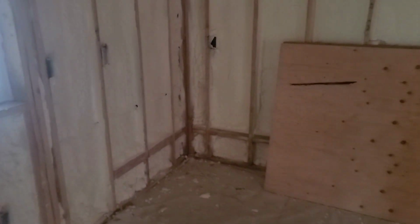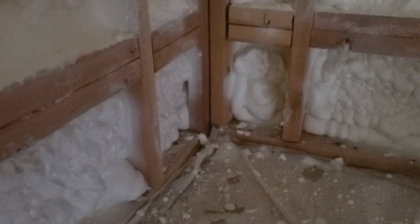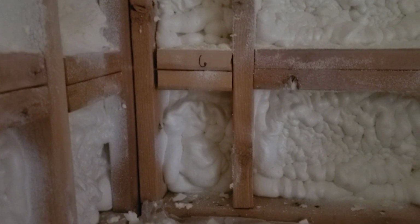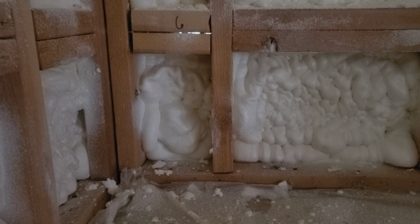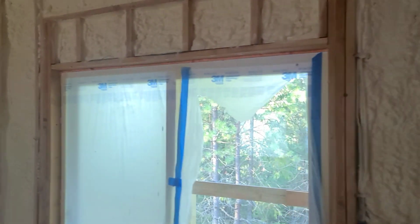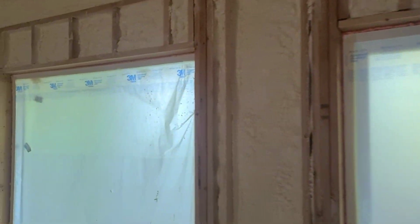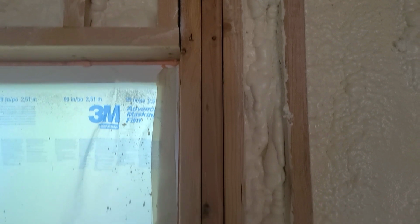So let's go around. I'm going to flip the camera. We'll go around this stuff. Some of the connection points, like that, that's a shear connection. Let's see if I can get the camera down there right. There you go. Do you see that light through there? That's a seam on the outside wall on the sheeting that matches up with that. The AeroBarrier guys came in and found all the holes, took pictures, and went around. Here was one, or they say there's one. They're looking for light through that and everything.